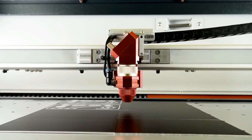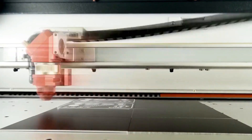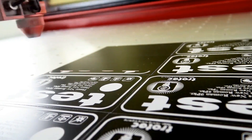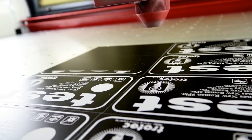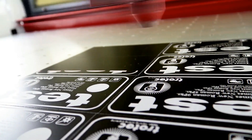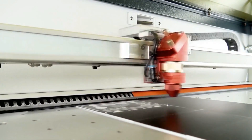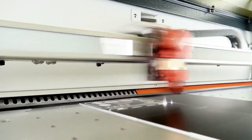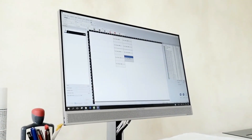Sometimes it's difficult to see if what you are engraving is truly out of focus — it could be the case that you don't have enough power. Be aware that materials react very differently. On anodized aluminum you are vaporizing the anodization on the material, whereas with plastics you have a melting process occurring as well. If you use too much power the engraving may blur, or if you don't use enough power it may not penetrate the surface properly and it may look like you are out of focus. Understanding the parameters in job control, experience with different materials, and use of the different lenses are rather important to quickly determine whether you are in or out of focus.